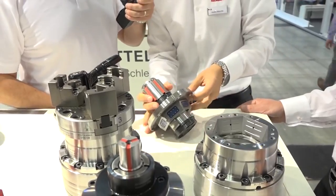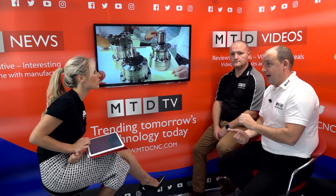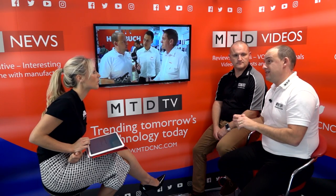You do see them everywhere. They invented this quick change solution many years ago. If you're an engineer turning parts that vary - going from one component to another - this system enables you to put a three-jaw chuck or change to a collet system, to a mandrel, and even now to magnetic chucks, all using their adaptations - totally versatile. It's about flexibility and changing over parts very quickly. If you're not cutting, you're not making money at the end of the day.